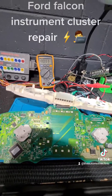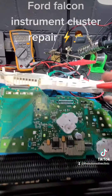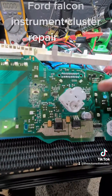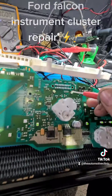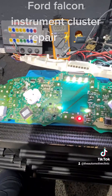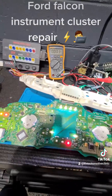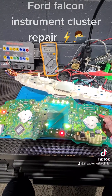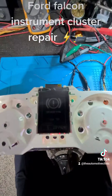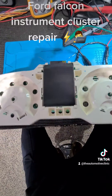How I'm going to prove that — and electronic guys will probably hate this — I'm just going to take a test probe, hook it to ground, and put it on the bottom of that pin. And our cluster comes to life. I'll flip that screen over and show you that the screen is all good. There we go, screen's flipped over. As you can see we've got all our warning messages coming up — and I just lost it there.